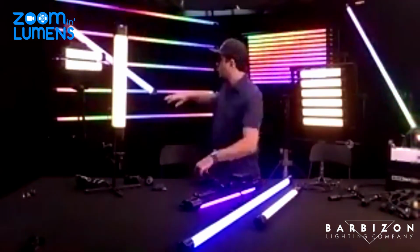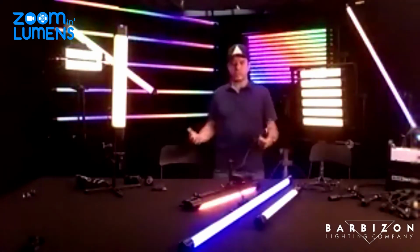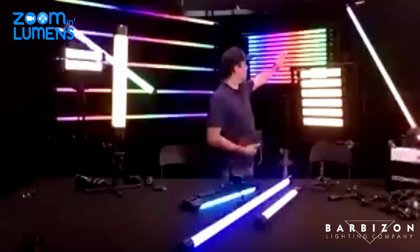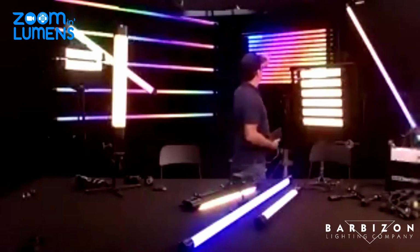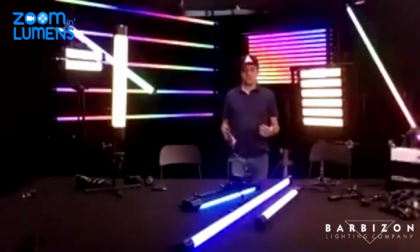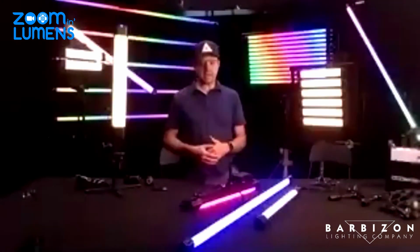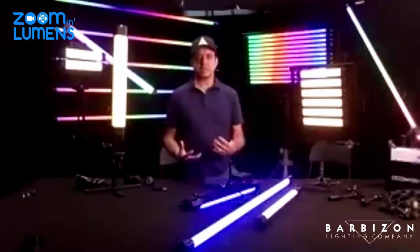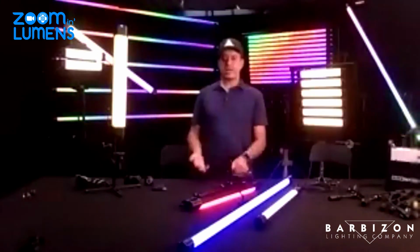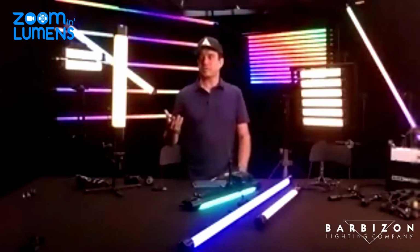Both are blue. Back here on our lead follows, we have cyan for the followers and red and green for the leader. Over on this side, the CRMX wireless DMX, you have red for the data, indicating that you're receiving data, and green indicating that you're connected to wireless DMX. So what all that tells you is how the system is functioning. Once you know the patterns, you can instantly look at the light and go, hey, that light's flashing. Why is it flashing? It doesn't have a signal, it doesn't have data. So it's just an easy way to see what the light's up to.